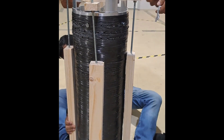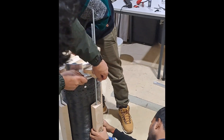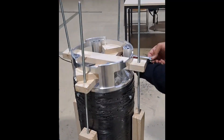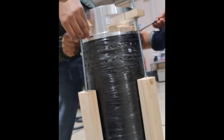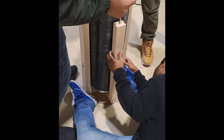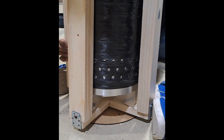We fitted four wooden spars along the outside of the tank, which connect to the cross on top to create a second anchor point. These four spars run the length of the tube, connected at the cross at the top, which goes through the top of our bulkhead as an anchor point. We can screw the nuts on the bottom, which put pressure onto the wooden cross on top and an increasingly high compressive force into these wooden spars, which eventually pushes the bulkhead screwed on the bottom out of the tube. We're already starting to see more of the bulkhead appearing at the bottom.